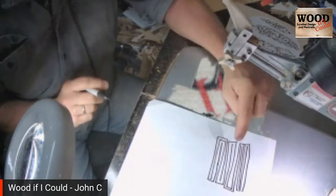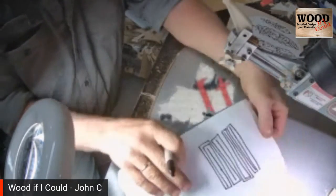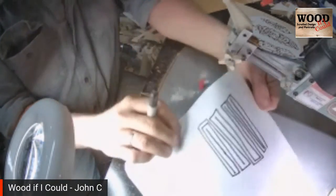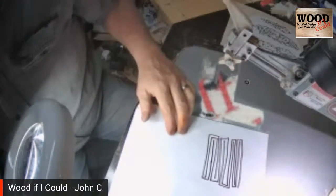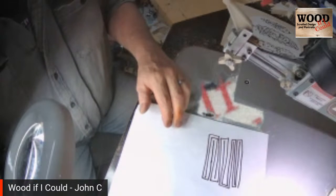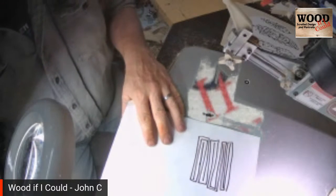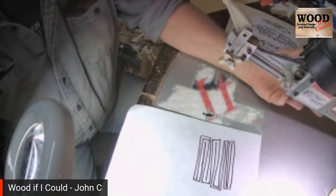So with that pattern cut out by laser right all the way through the wood, you can actually take the wood and curve it like that without breaking it. And I'm like, I can do the same thing with a scroll saw. So I tried it, and it's a little more difficult with quarter inch wood. So you've got to use skinnier wood, like 1/16th wood. Yes, CNC does it also, but with the laser, it's quick and easy to do.